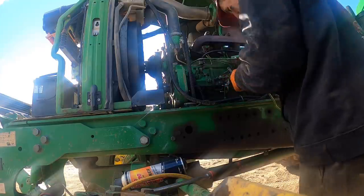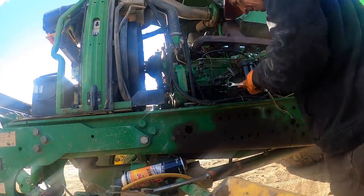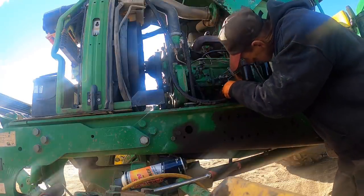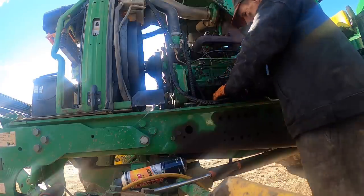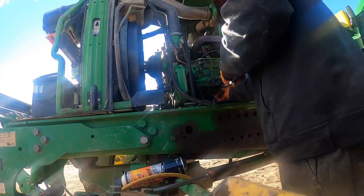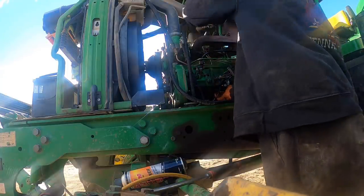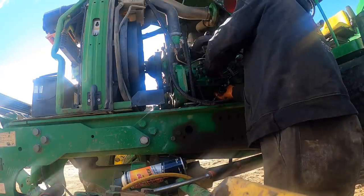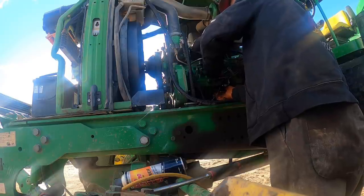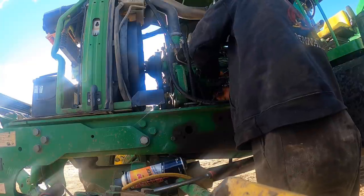The window for the hub on the front idler was leaking. So I told him, let me fix that. I don't want him to run that idler out of oil. So I went down there this morning to get the serial number because I couldn't find it in my phone. I thought I took a picture of it, and to call Cat and get that hub. You got to buy the whole hub cover assembly, because that window is like glued in there. It's not like a Stemco kit where it's got the little torque screws and you can buy a window kit. No, you got to buy the whole thing and the gasket.